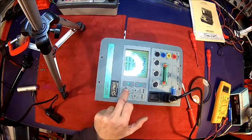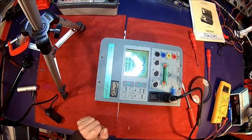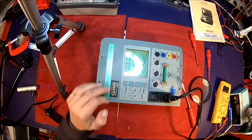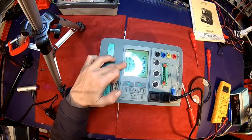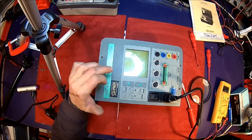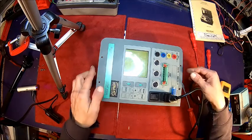I had it running for a while just to make sure the battery is not the issue. We're still in the boot loop. That's bad. Apparently it's reading the EPROMs because it says release 2.59, that's what we found on the EPROM. We may have bad memory. It's difficult because these things are, there's no drawings. Anyway, we'll find it somehow.